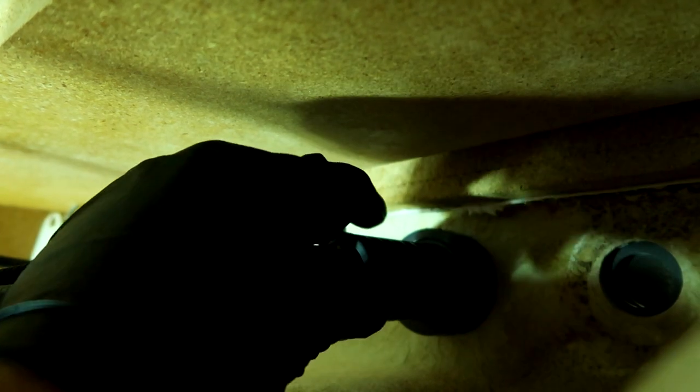This is pretty awesome - I pretty much just pushed this up onto the shaft all the way up to the top of the sink, and then I heard a click. That must be giving me the signal to turn it to the right - righty tighty - and sure enough it's tightening up. So when you hear the click, push it up until you hear a click, and then you just start tightening it down. No wrench needed - that should be good, nice and snug. Now we can hook up our water lines.